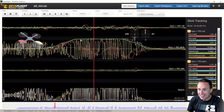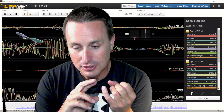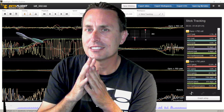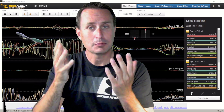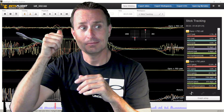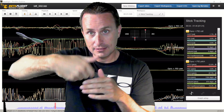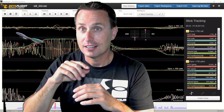This has nothing to do with high throttle — I'm at zero throttle. If you see spiking just when the motors spin up to arrest a move, that could be an electrical noise thing; maybe you need more capacitance. But when you do a slow flip or roll and you see the spiking in the gyro on whichever axis is the trouble one — and the motors are at idle — then it's just the pitch axis reading that pitch rotation, spiking up and down like you can see right here.